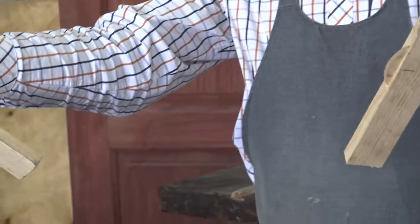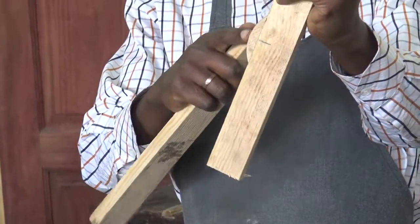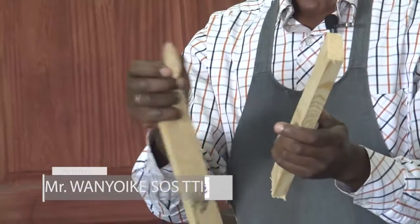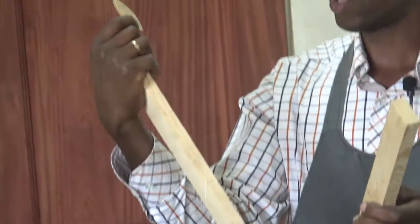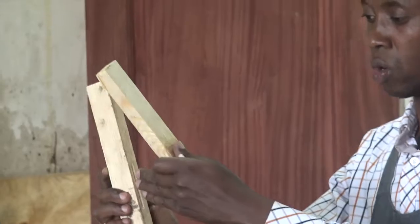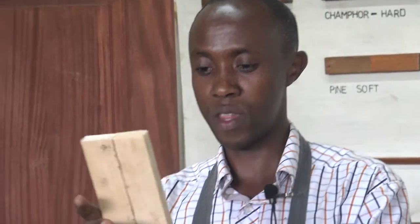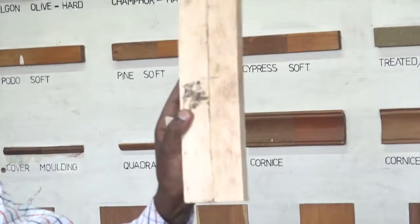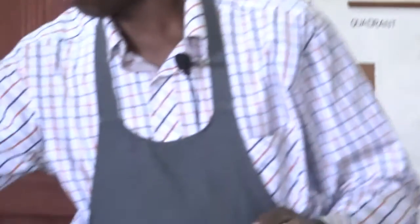But now they are tightly held by the biscuit. Inside here we have the biscuit. This one is mostly known as the lamello, because it's the company that makes these. The original company that made that machine is branded as lamello. So once you put a groove on one side and the groove on the other side with the biscuit groover, and you bring them together and fit them tightly, you apply glue, hold it together, clamp it, then your piece is strengthened. And if it can hold without glue, how much more with glue?